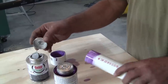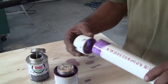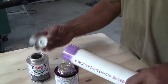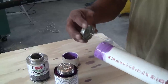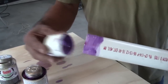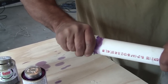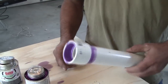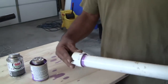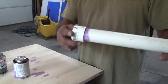Now we go with the glue. Keep in mind you really want to do this in a well-ventilated area. I'm putting the glue on the pipe rather than the fitting, because if you put it on the fitting it will push all the glue up into the other side — you don't want that. Go right around like this, nice and thick with good coverage. Get the fitting and don't wait long — this has to be done pretty quickly. Push it on and give it a little turn to make sure it's seated with full coverage. Give it about 20 seconds and you won't be able to separate it. That's how you connect a fitting — in this case a coupling — to white PVC.